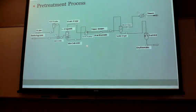From the top, you have the wash water. Then it went into a solid washer to wash out the dirt and contaminants from the switchgrass, where you had your wet biomass and vapor steam, which finally went to a solid dryer to get rid of the water in order to have dry biomass, and went into a ball mill to break down your dry biomass.